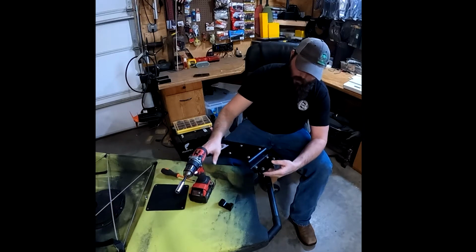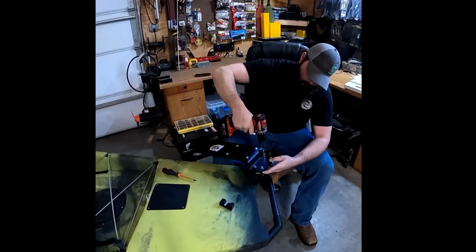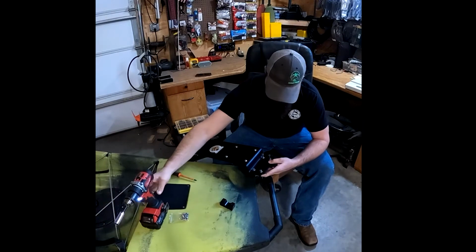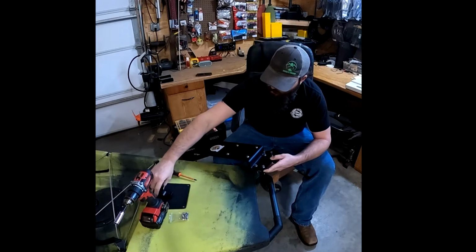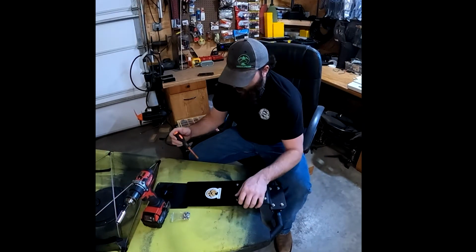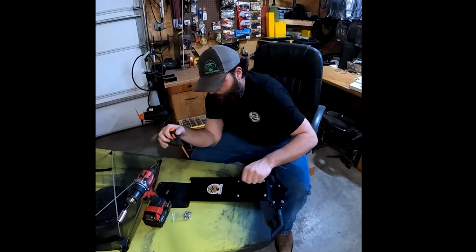You're going to want to hold the top part so it doesn't fall off, because it sits on top of the H-rail. And as you loosen those up, you'll be able to get your hardware bag loose. Pull the bottom of that one off. Set those clamps, the bottom parts of the clamps, out of the way for now, and you can actually set that on the H-rail. So go ahead and take these Phillips screws out of the back of the rudder cover plate back here.